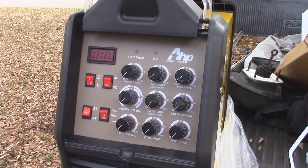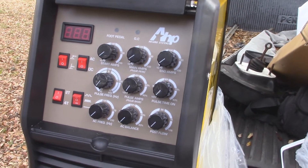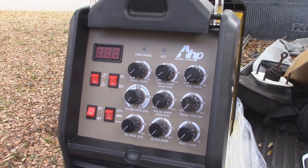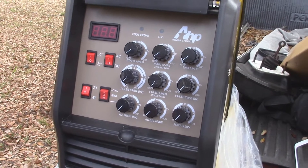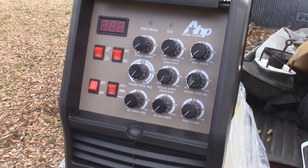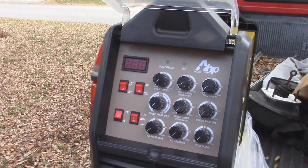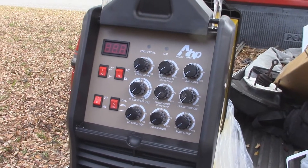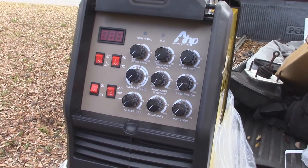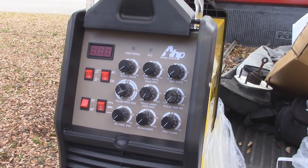I'm a bit taken aback by this machine because it looks a lot more complicated. It's way more complicated than the stick welder I have - I've got a Hobart Stickmate, and it's way more complicated than that. Stick welders are very simple: you set your amperage, you set AC or DC, positive or negative, put in your stick lead and you go. MIG welder there's a little bit more - you can set your amps and wire feed, but for the most part there's very little setup. Some MIGs are more complicated, but mine isn't. This thing here, I'm just like, what have I gotten myself into?